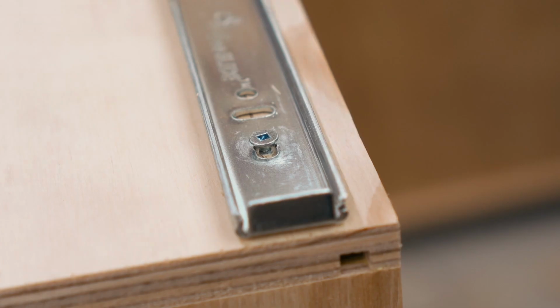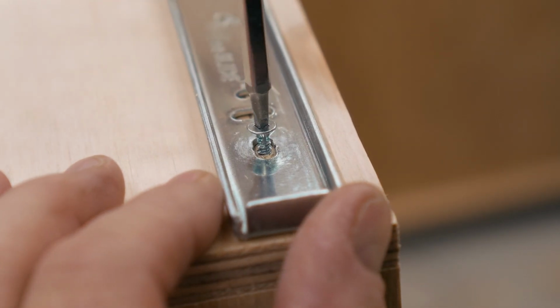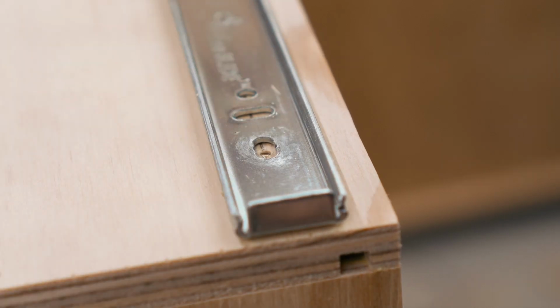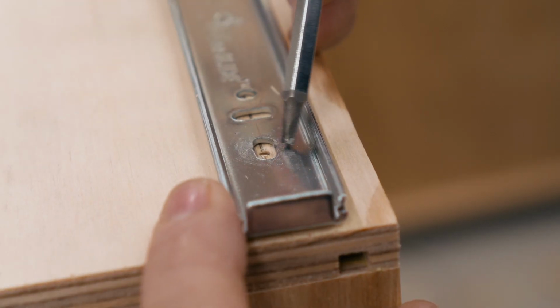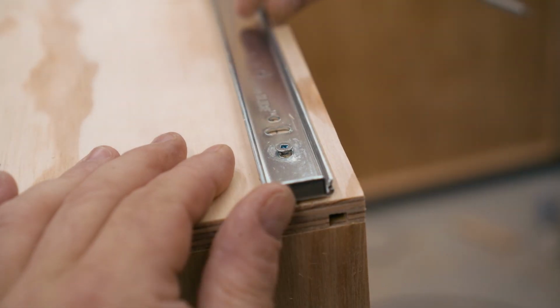The one. Even when you put these screws in an elongated slot, they'll still lock the slide in place because the underside of the countersunk head will make a small detent in the side of the slot. However, it's not to the point where you can't make adjustments.